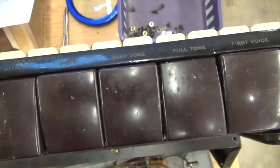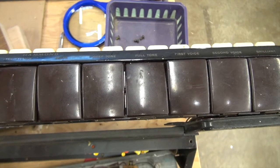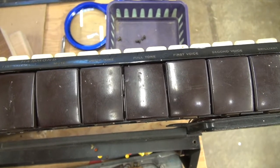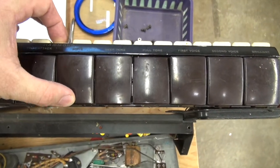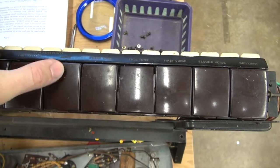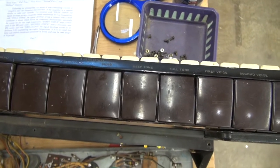Mute: six half-wave rectifiers in three double-diode tubes — V10, V11, V12 — are normally shunted from ground to the six output wires of the oscillator and frequency dividers. The tone produced is a string of odd as well as even harmonics. When the six diodes are disconnected by turning the mute switch on, a clarinet-like frequency of tones is produced. It's not a very dramatic effect, but you can hear it, and especially if you go into the bass range with mute on — kind of clarinetty.